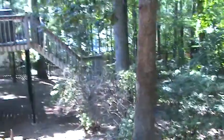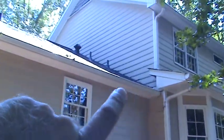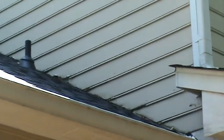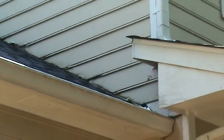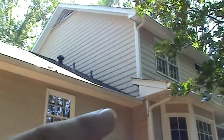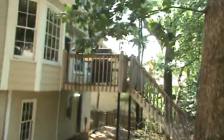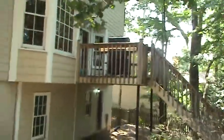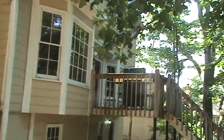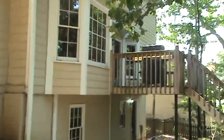The back side of the house is in pretty good shape except for this one section over the roof. If you look back up here, the siding is on the roof, but get up around these vent boots and you can see how rotted all that stuff is — there's a whole wide opening in that bottom corner. So we'll replace the bottom six rows right there and cut back the rest of the siding to give that inch and a half to two inch clearance. All the rest of the siding back here is good. There's a bay window out over the deck, and the center nose on that window is rotted through while all the rest of her siding is in great shape.